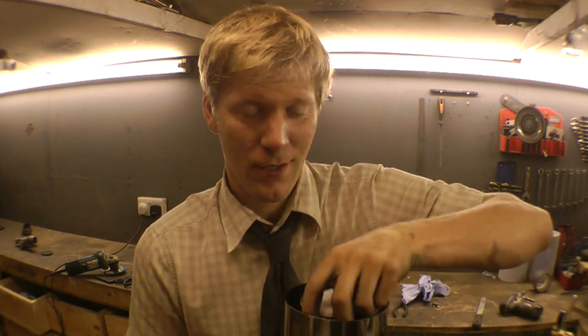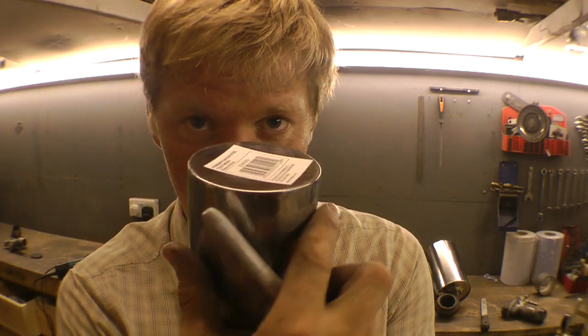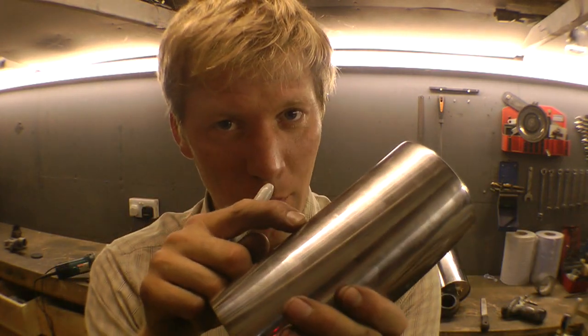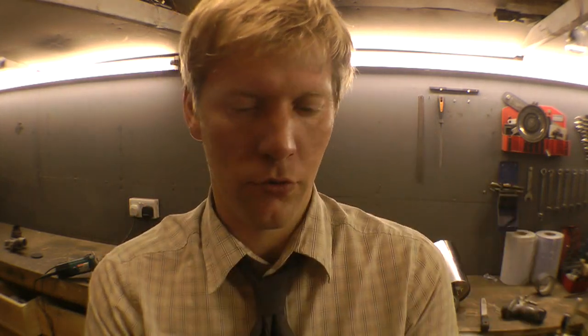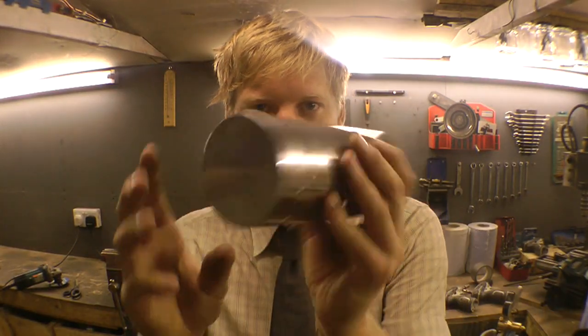Before we do that, there's a little bit of holes in this. This is the plan: we're going to do 18 4mm holes across the first bit, 5 7mm holes, and then 5 11mm holes. There we go — toilet brush holder, now a flame tube.